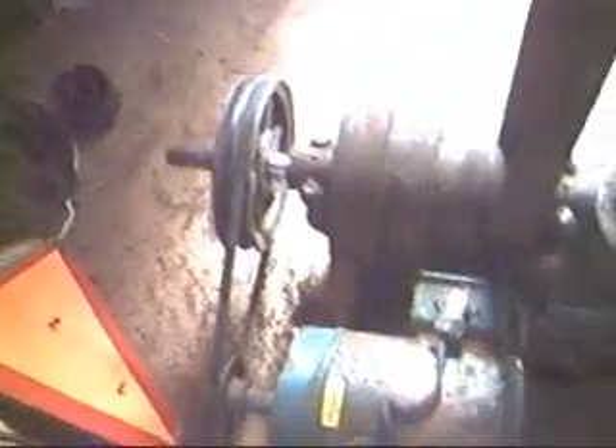This is the motor — the old motor off the iron worker, the old three-phase motor. This thing I had all disassembled. It's got a flat belt that runs up to the drum, it goes across. I'd cut the shaft in two and put a gear box and motor in it. Now I had to re-weld the shaft and true it back up on the lathe. It's still probably got about 60 thousandths out of round there, but that's on its lowest speed setting.